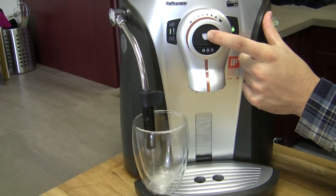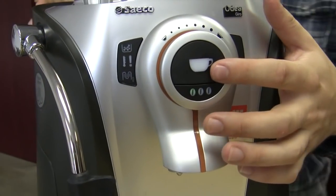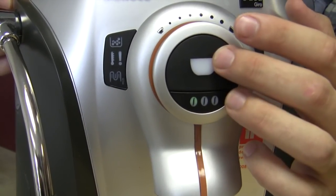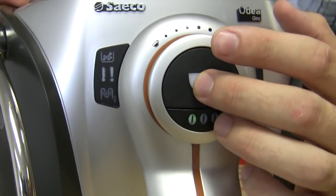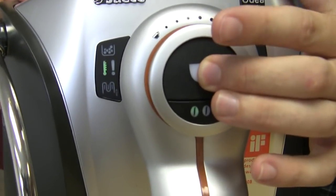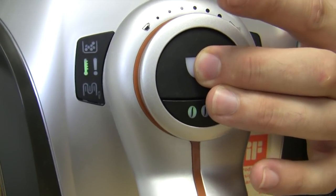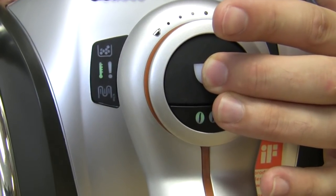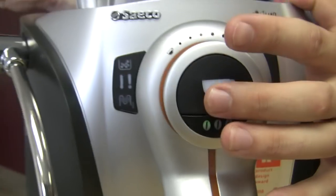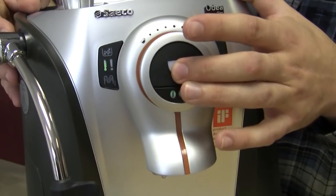Now there's something else that's really cool in test mode. Right here the thermostat light is actually showing you the revolutions for your flow meter. There's a turbine in your flow meter with a magnet and it's hitting a transistor every time. So when I do this it's actually showing you each revolution. And as you can see the lighting flickering is very consistent. Sometimes in test mode you can see that it will be flickering and then stop, flickering and then stop — you might want to get in there and try to clean your flow meter out. But this is looking really ideal as it should because it's just been refurbished.